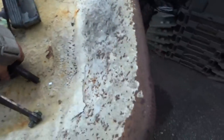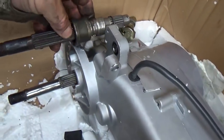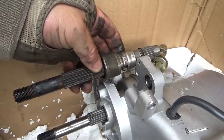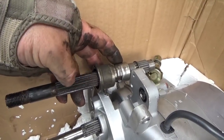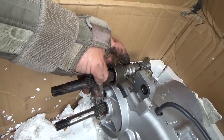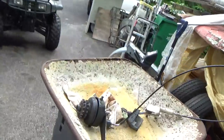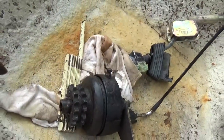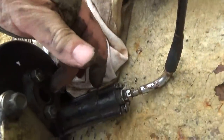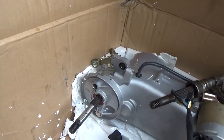So now I'm thinking I just have to put this shaft over the other shaft and all is good. I bring it over and start looking at it, and I figure out pretty quickly that things are a bit different — see how long the threaded area is. I slid it on and sure enough the bolt did not poke through the other side. It caught the splines but didn't poke through, so this isn't good.